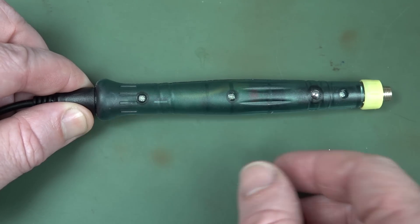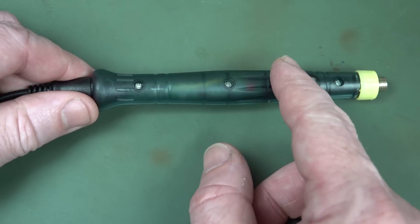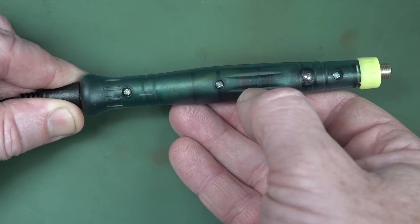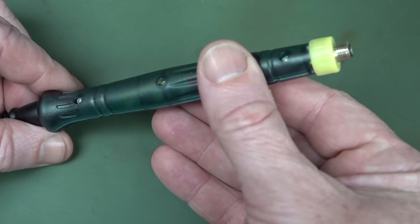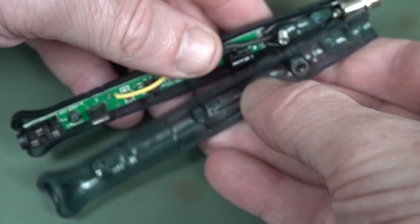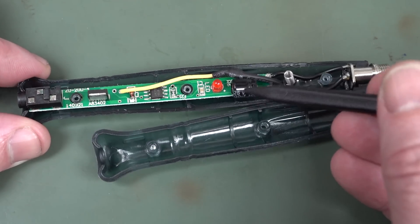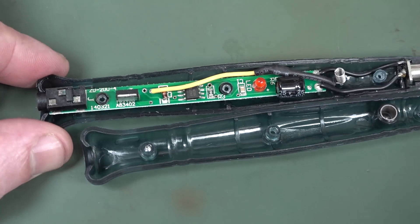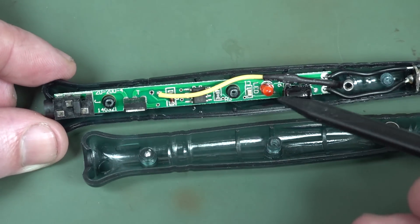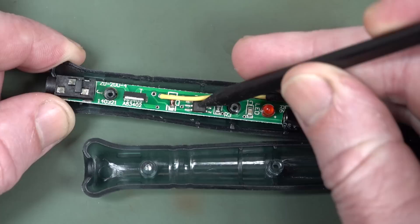Let's take it apart — we've got three screws here. I expect nothing fancy: just 5 volts directly to the heating element, via a MOSFET or something like that, and just the touch sense — probably just a re-triggerable monostable with a touch front end. Could even be a 555. It pops open. Got a little spring there that connects through to the touch pad. Got a big electrolytic in there — that'll be a 100 µF one. Yep, just got a MOSFET as suspected — just the MOSFET switch for the 5 volts going straight through to the element. And there's the wire going over for the touch — and that will be our monostable.